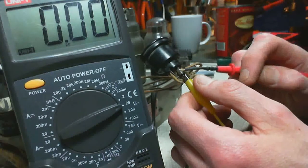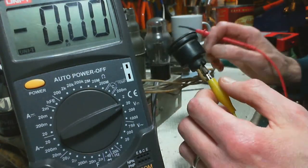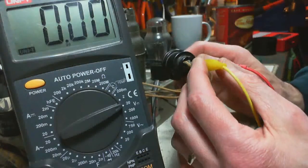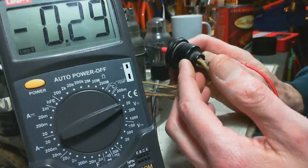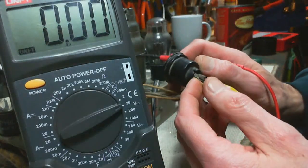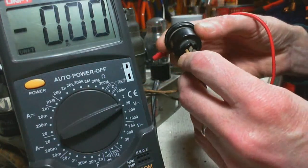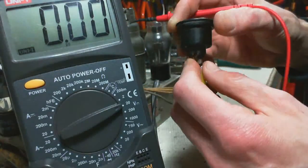Well, I don't think this resistor is going to be different from radio to radio. It's going to be very, very similar in size, so we can figure out typically what that is. So far, the impression I get is it's open circuit or something like that. That's not so good. Let's take this apart. We're going to have to anyway, because I'm pretty sure we've got to properly test that resistor.